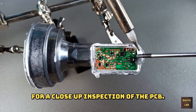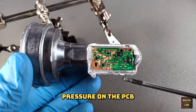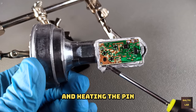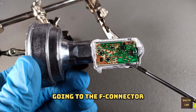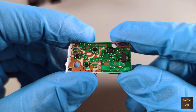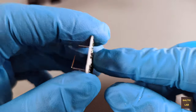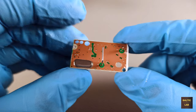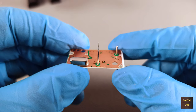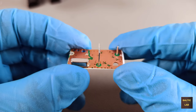For a close-up inspection of the PCB, it can be removed by applying slight pressure on the PCB using a screwdriver and heating the pin going into the F connector with a soldering iron. The entire board is extremely small. On the back side there is not all too much happening — there are the two monopoles on the right-hand side for horizontal and vertical polarization, as well as the 25 MHz crystal for the reference clock signal.